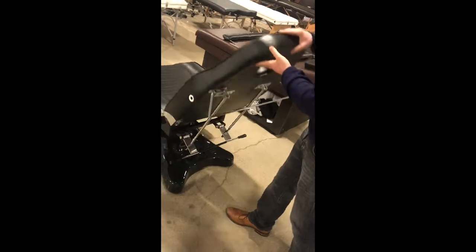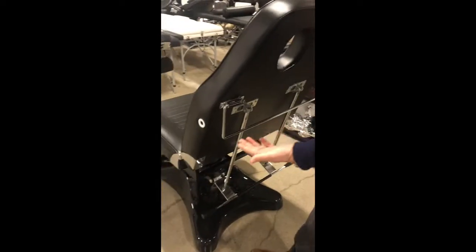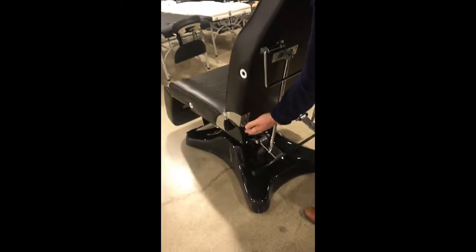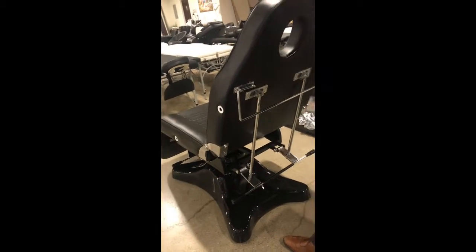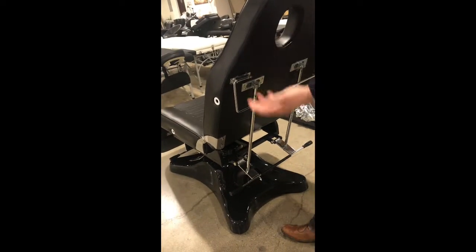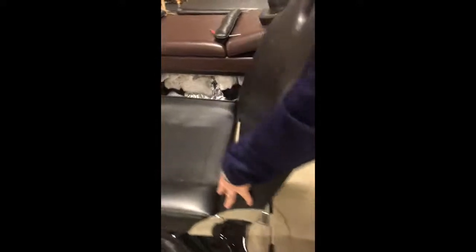What that causes is these bolts to misplace a little bit. If each of them gets misplaced approximately one eighth of an inch, and you have one set here and one set here, it gives you approximately a half inch gap or misplacement. So what we're going to do — in this example we just made the left side of the backrest higher than the right side.